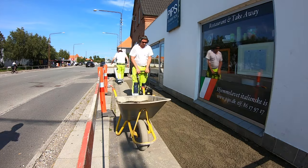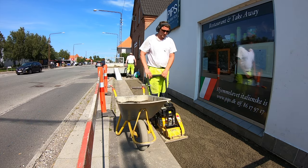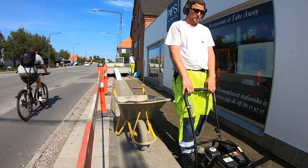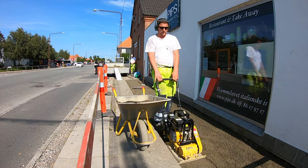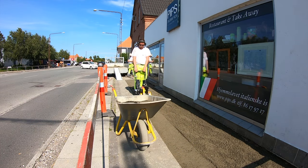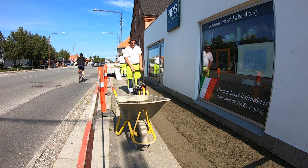You can skip the concrete pouring if you are not willing to invest a lot of money in your project, but I would strongly advise you not to skip it, since it will prolong the life of your asphalt by many more years. But if you do skip it, make sure you treat the soil against weeds — you can basically go with a total kill pesticide — and avoid having weeds and plants growing through the newly laid asphalt.